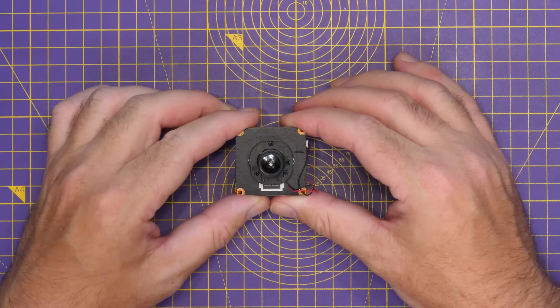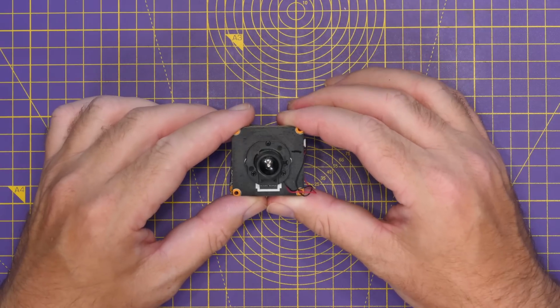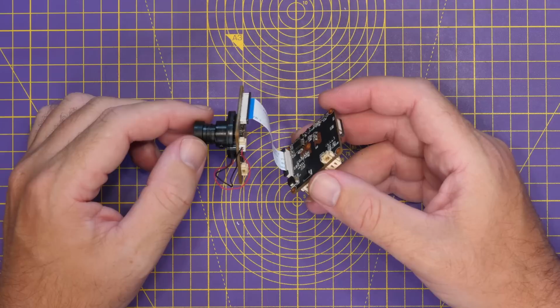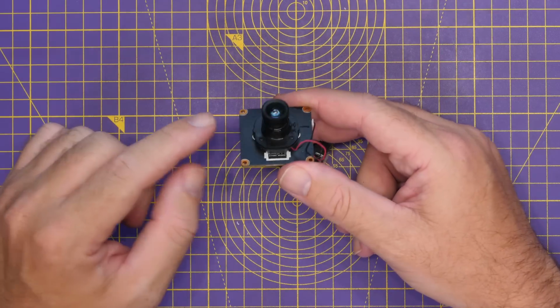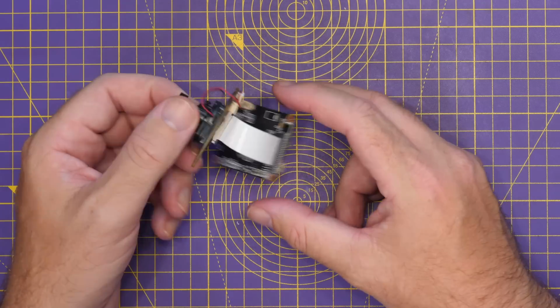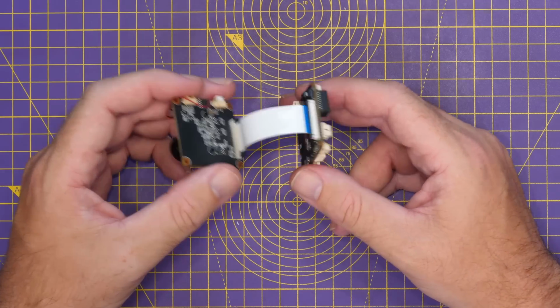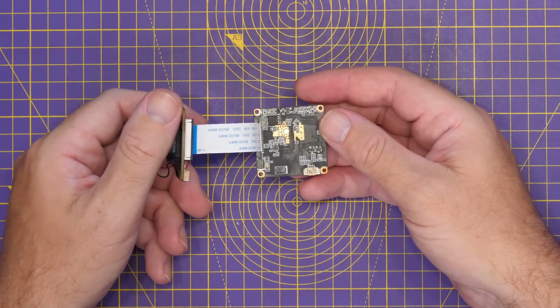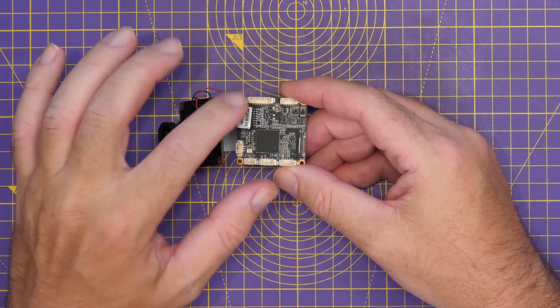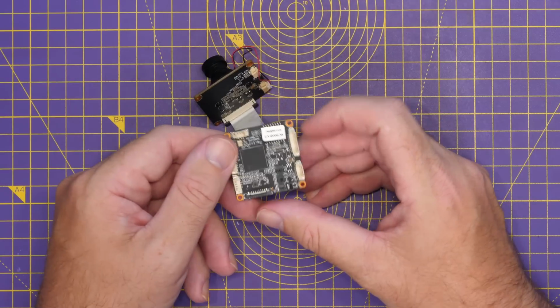Anyway, let's get on with it and let's take a look at what OpenIPC actually is first of all. Okay, so to start, we're going to take a look at this CCTV camera. Now, this is a typical 2-board CCTV camera design. On our front board, we have our image sensor under here, our lens, as well as our IR filter. There's then a MIPI interface that goes to the backboard. You can see on this side here, there's some power regulation. There's a flash chip, as well as all of the I/O and the main chipset on the back here.